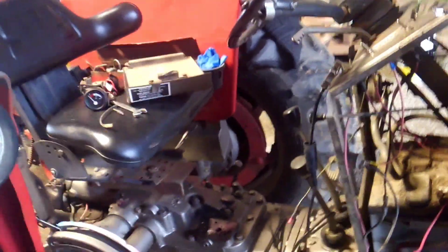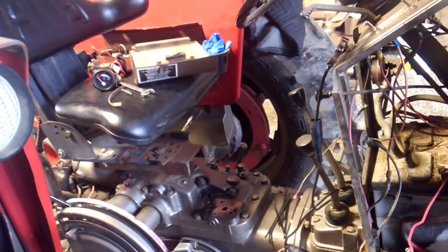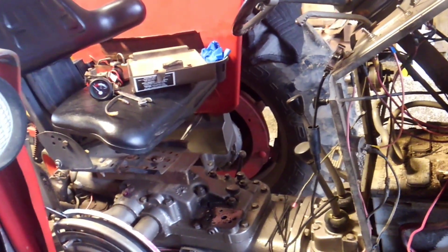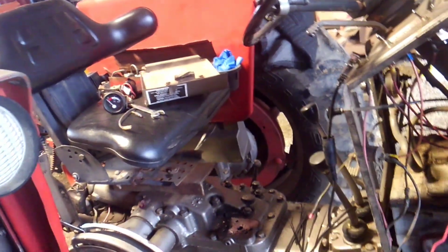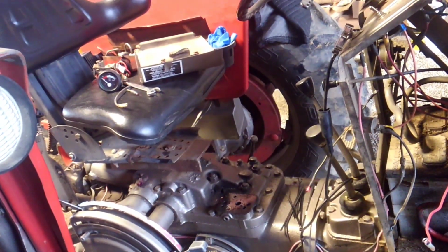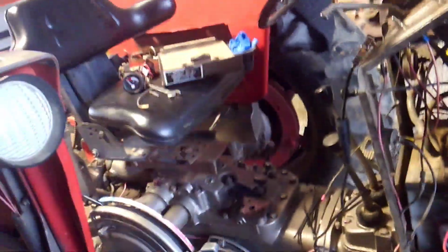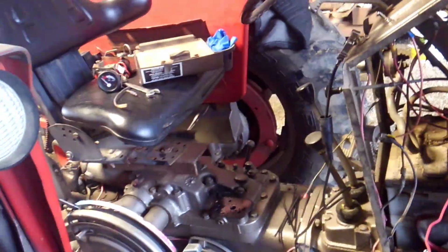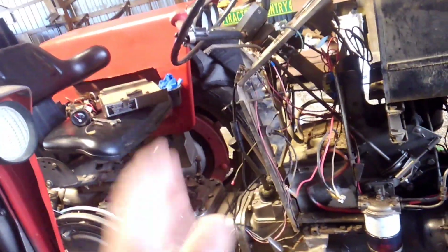So, you know, it's stuff like that you don't know, or you've got to take. There's a little dowel pin in there you got to take loose for the lift to be able to pull the top cover off for the lift control. And I wouldn't have been able to research it on the internet. I wouldn't have never known that, and we'd have pulled the top off and ripped that thing in half. So it's stuff like that I really want to show people and make sure they know before they tear into this, because there are little tricks to stuff. You know, there's nothing complicated. It's just you got to have a little common sense about you to do it.